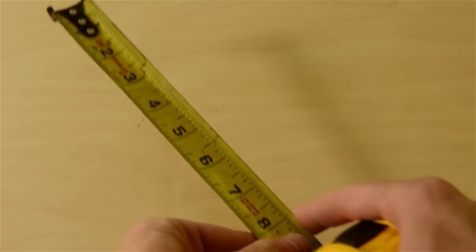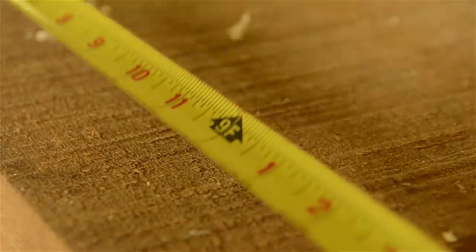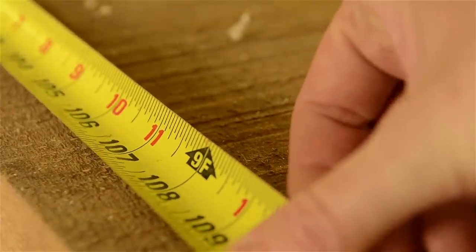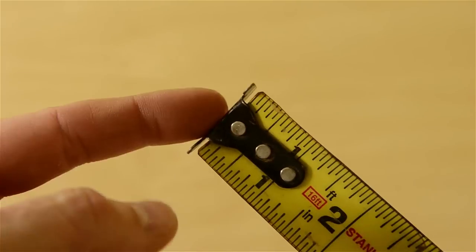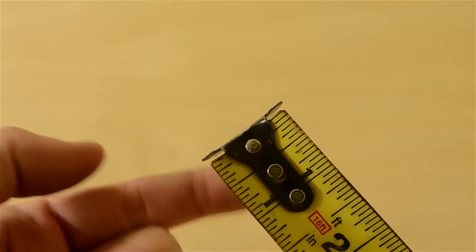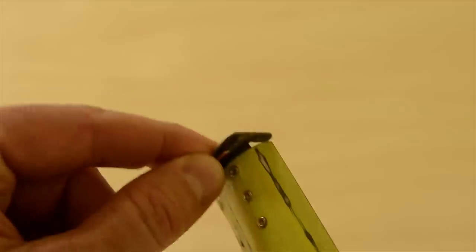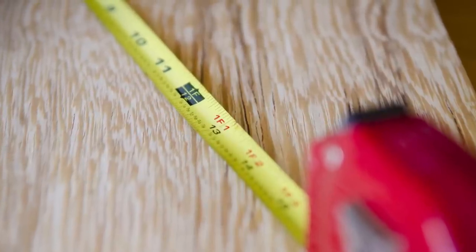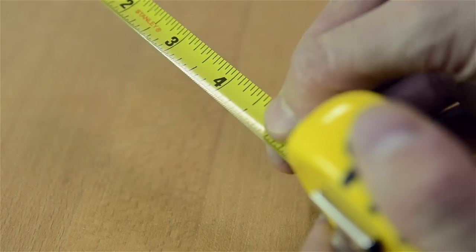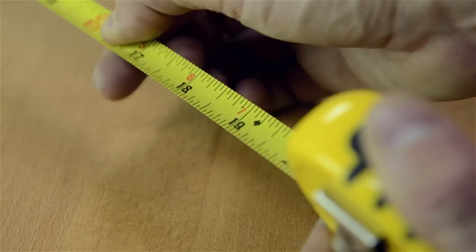If you don't own a folding rule, you can certainly use a tape measure. I use a tape measure mostly for rough measurements or when I go to the lumber yard, because folding rules aren't long enough for long pieces of wood. In my opinion, it's easier to get measuring errors when using tape measures, especially if you don't know why the metal hook on the end wobbles. I like to have a shorter 12-foot tape measure for most woodworking applications, since I rarely measure lumber over that length. When doing carpentry work, I like a tape measure that extends over 25 feet. You really don't need to buy two tape measures — just use what you've got.